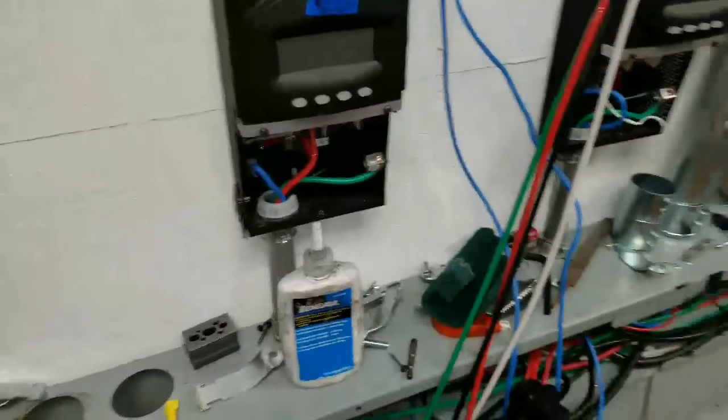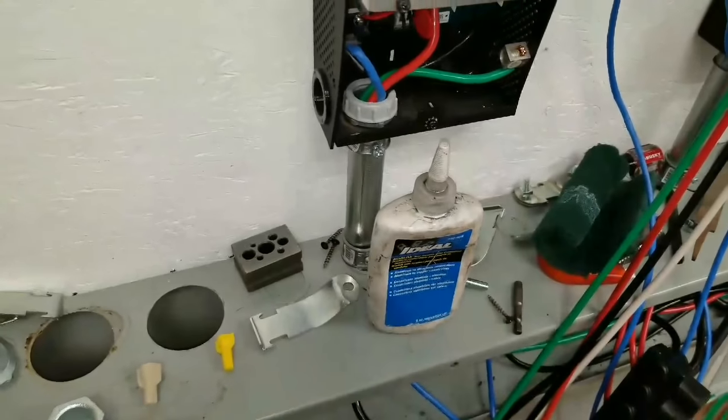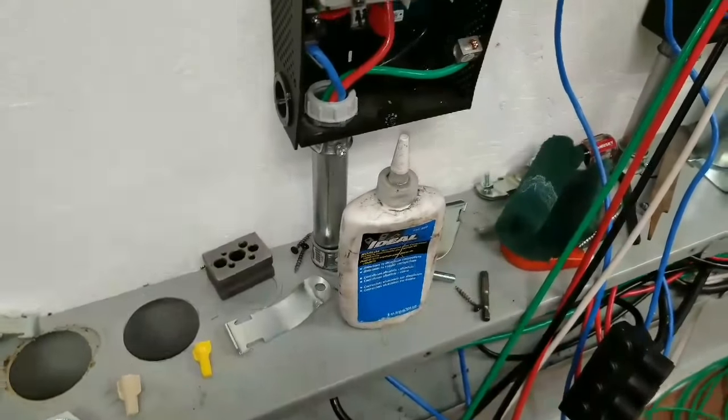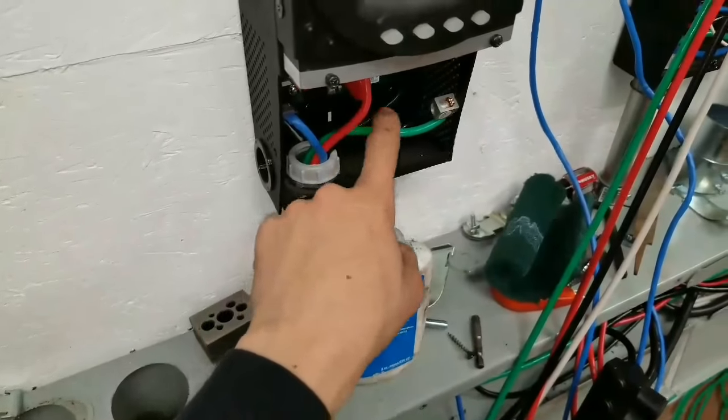And then I have over there some 4-inch gutter. And I'll have a second step. That way I can have all my Outback charge controllers. I'm starting with 2, but I imagine in the future I may have up to 6. And I got these 1-inch chase nipples, so I can have these instead of this conduit like this, which I don't like the stress on the wires and whatnot. I'll pull that out and do it proper. 2 chase nipples, that way I'm not exceeding wire fill. I can have controls and power in separate locations. So that's the plan.